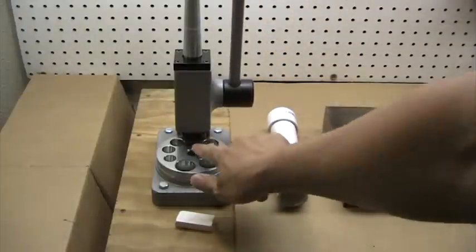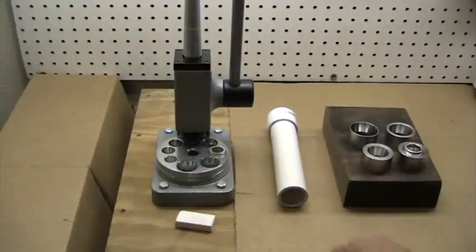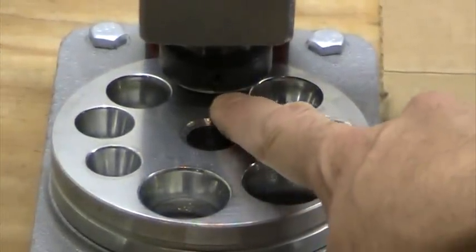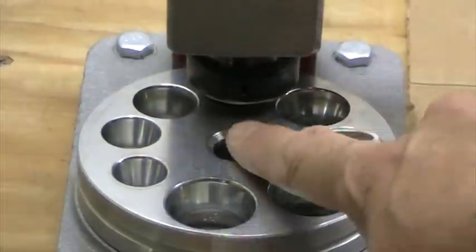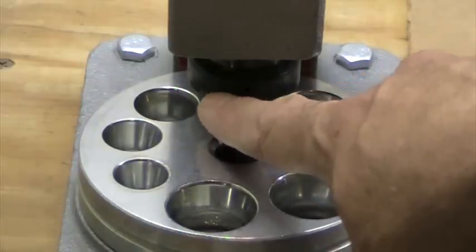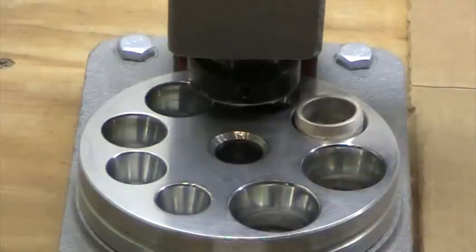At the bottom of the ram here, used on the reducing plate to reduce the coins — this is the reducing plate that can accept and size up to 50-cent half dollar pieces for reduction. If you zoom in, you can see that thin little strip on the bottom of the ram head — a gray strip. That's actually the friction-resistant tape you see on the expanding mandrel that protects the detail of the coins. I put it on the bottom of the ram head because the factory coating — it might be a heat-treated rubber coating — degraded over time on mine.